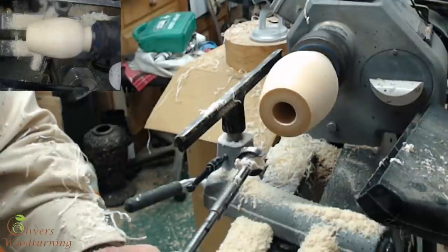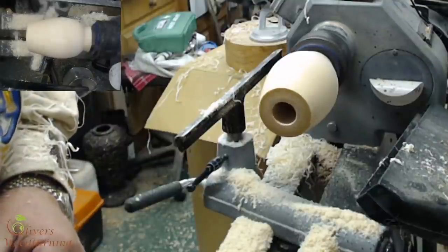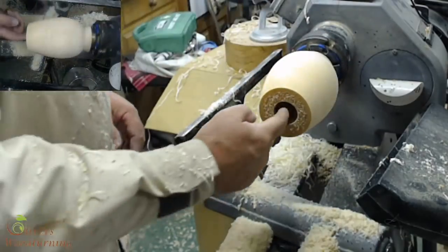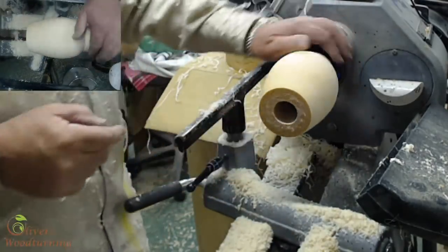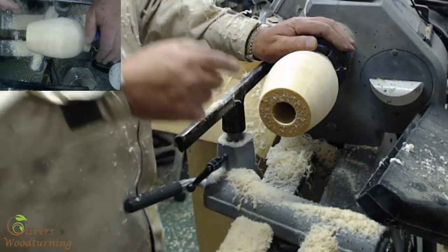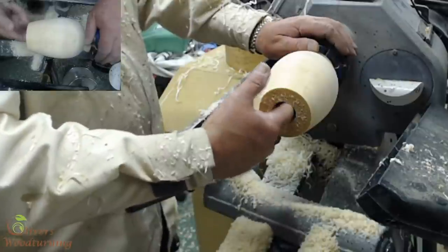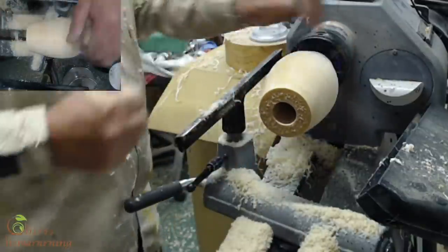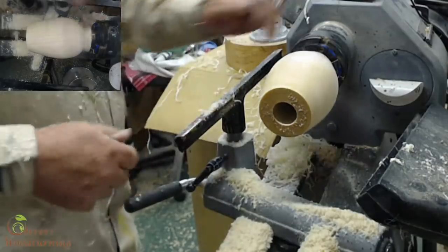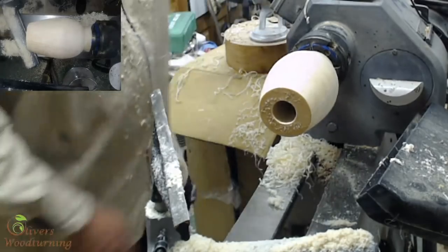I've kept the shape quite simple. Too complicated, and it's not because I'm simple. It will cut easily with the Forstner bit. The question was, would it be worse when the wood is wet? It cuts easy in wet wood. What will happen is the shavings will expand in there and get a bit stickier, so it could trap the Forstner a lot easier. So just be mindful: 10 mil, bring it back out, 10 mil, bring it back out. That's the best way.